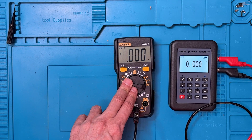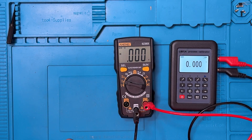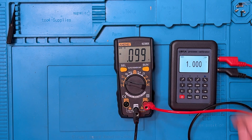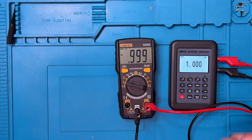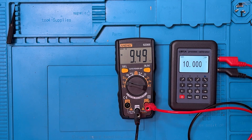I've got the multimeter set to DC voltage with the calibrator outputting voltage. Starting at zero, we connect it — still zero. Increasing to a tenth of a volt, there's effectively almost a rounding error difference between what the calibrator puts out and what the meter reads — about one millivolt. At one volt, we're off by one millivolt again. At five volts, just off by what amounts to a rounding error. At ten volts, the same sort of thing. Very good performance for DC voltage.